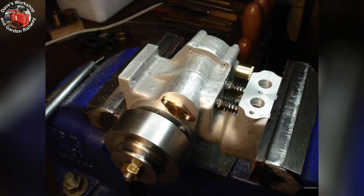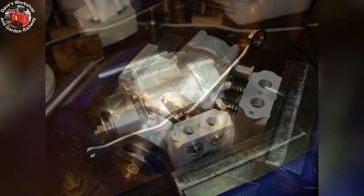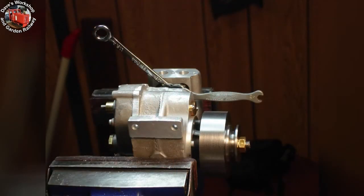Getting ready for the first valve timing. You can see the tall brass crankcase ventilation cap — it's a special one with a ball that vents positive pressure but retains vacuum, as a measure to reduce oil leaks. Here we are with the inlet valve open and spanners on the collar nut and lock nut — these nuts were made years ago but luckily retained. The 1/4-inch AF lock nut is very thin; luckily a 4BA spanner fitted nicely. It went well, and some more involvement of the Dremel with the valve pockets was needed.